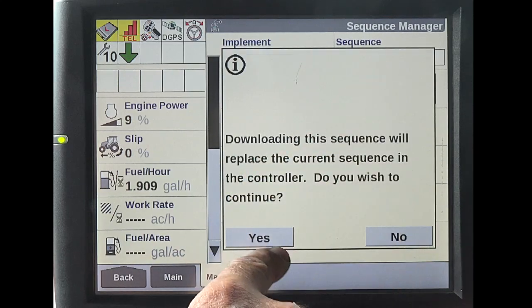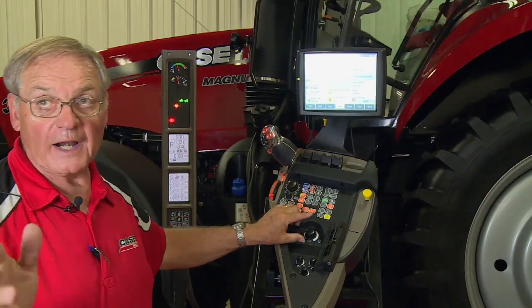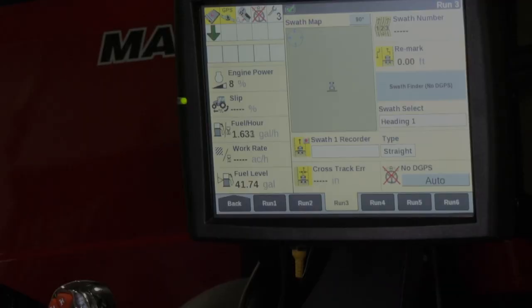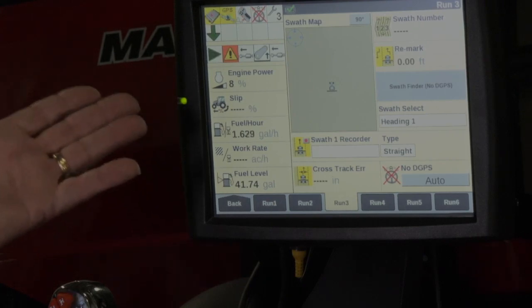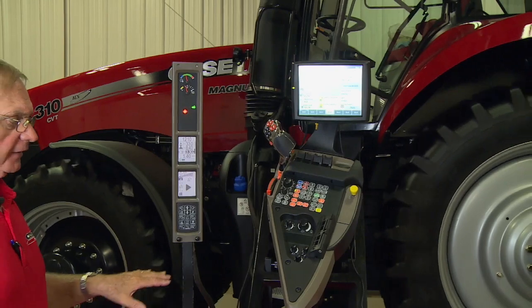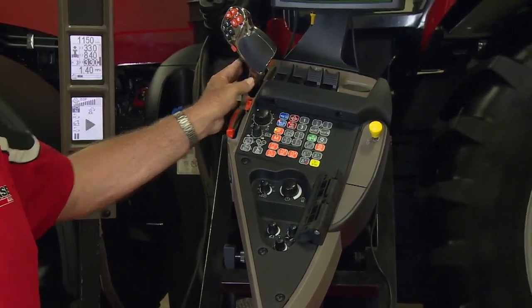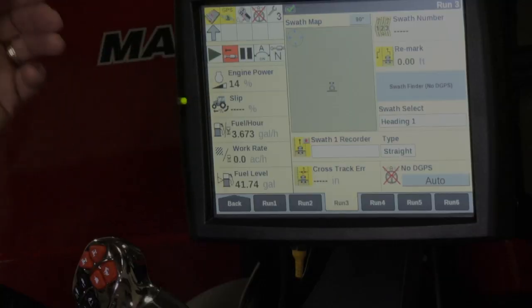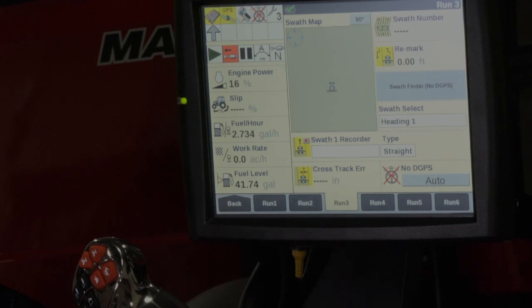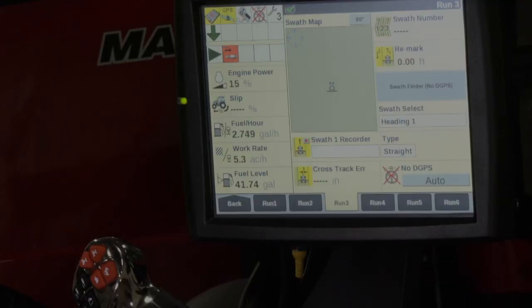Now I can download that sequence and it should come back that it successfully saved. I am ready to operate with that sequence — turn the system on and my sequence is there. In order to play back the sequence, we have to be driving the tractor. I've activated the button on the left — as you can see it flashing here — everything is ready to go. So now when I get to the headland, all I do is hit the button. At that point, my hitch comes up, my remote valves are activated, everything comes up, and the unit goes to pause. I turn around, hit the button, my guidance activates, the hitch comes down, both of my remote valves are activated, and the system is ready to go for me going through the field.